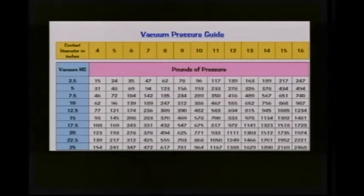The other part, when you're turning off the bottom, usually you turn the bowl over and you're turning off the foot or something like that. Especially if it's not up in the high range and you can't get it that way for some reason, then I always try to push in instead of turning across it. That way you're not fighting the pressure. If you push in against the lathe, it's helped. And also, if you can, leave the tailstock up as long as you can, right at the end. So those are two things you ought to think about when you're doing that.